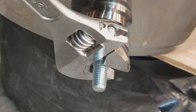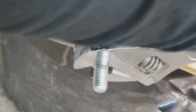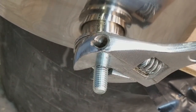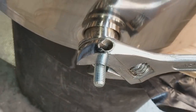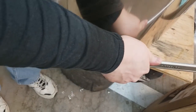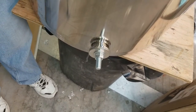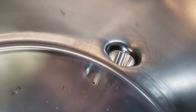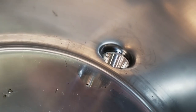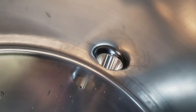Let me continue tightening to show you what the finished project looks like. Now it's starting to get easier — it's about to pop through, you're going to hear a pop. Right there — that was the bullet mandrel popping clear of the pot wall. If you stop here the ferrule is likely going to fall out, so figure out your wrench position and do another full turn, go all the way back around, and a little bit more for good measure. Then take it apart and see what we got.